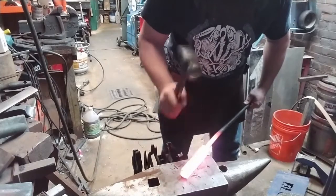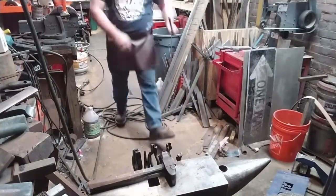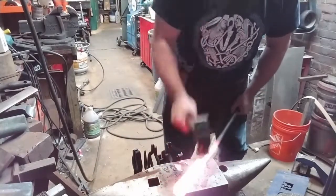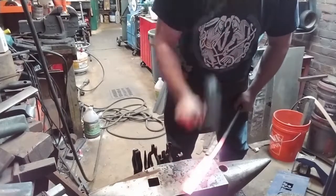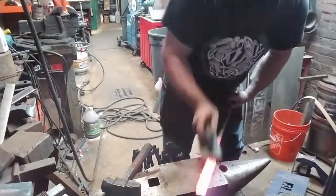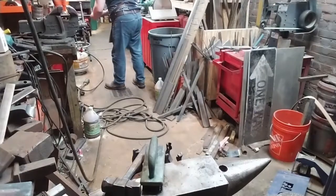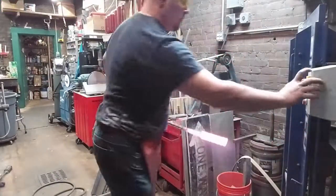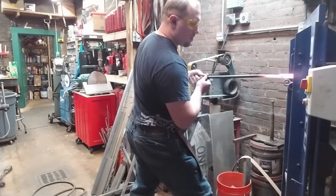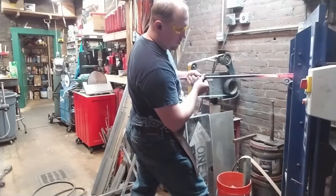I'm setting the weld. I'll be setting it a couple of times with light hammer blows on the anvil. It doesn't take a hard strike, and you can see the flux erupting out of the weld seams. That's a good sign. It's also necessary at this stage to keep the welds clean, just in case you might get any separation. You always want to do 3 welding steps, to tack, to set, and to blend. Or in this case, to set a little bit harder.